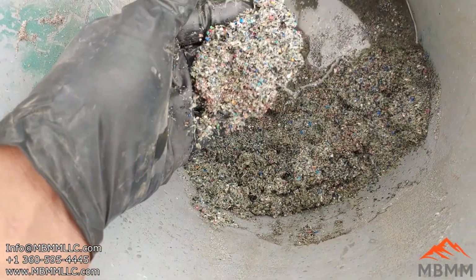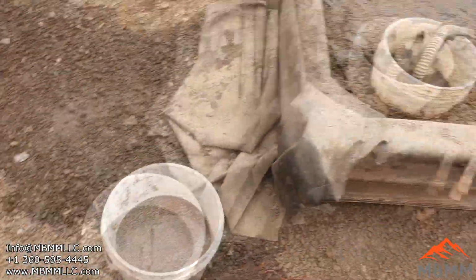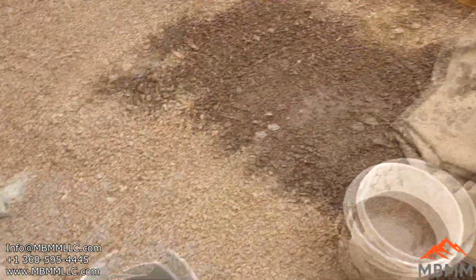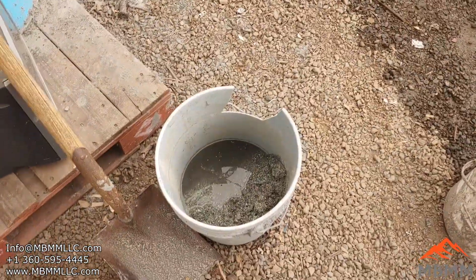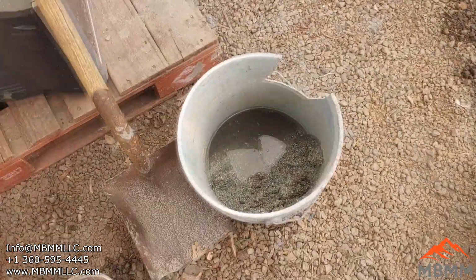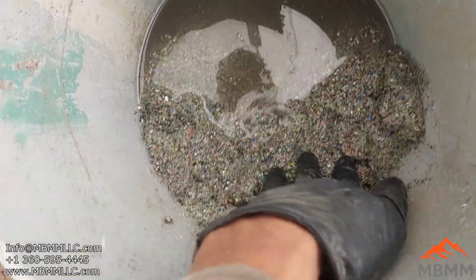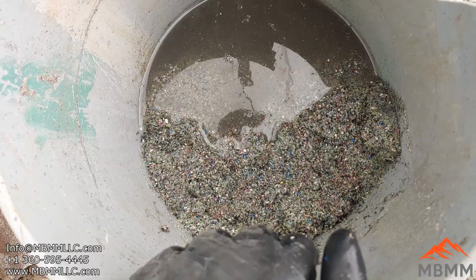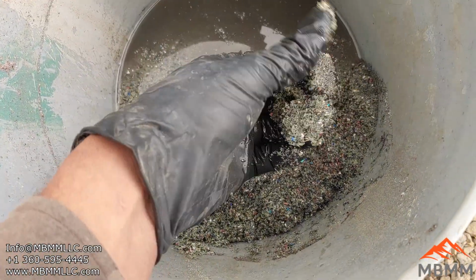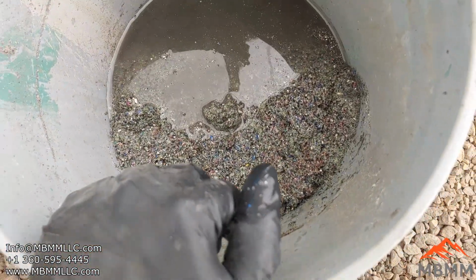And then the number 4 just went into the tub. The tailings, the true tailings, just went into the tub there. And it's real fine stuff, all the plastic that floats. There's hardly any copper in there. If there's enough, you might want to run it again or get a longer splitter there on the table and make a better cut between the copper and the fiberglass. So most of this fiberglass and plastic can go in the tailings and the waste.